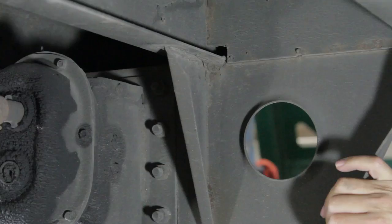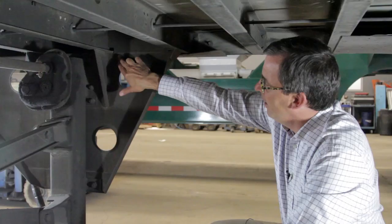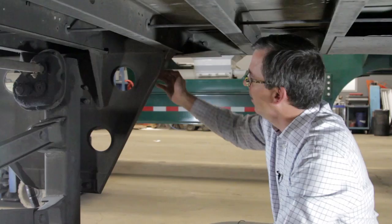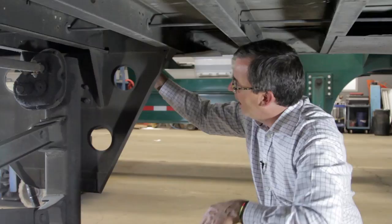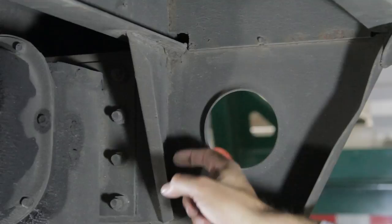Here on the roadside of the same trailer, you can see this is the original wing plate and the stiffener here comes down and it slightly overlaps the wing plate. There's a tack weld here and then on the opposite side there's a little stitch weld.